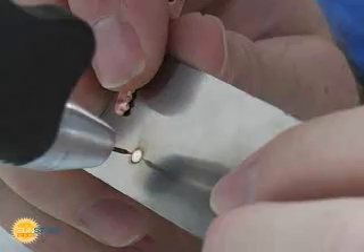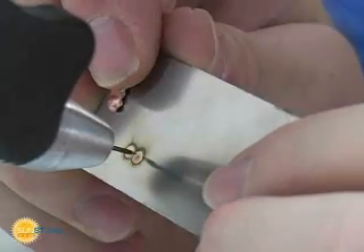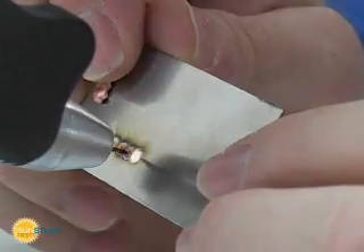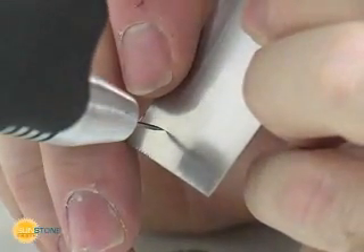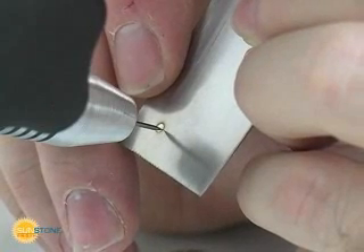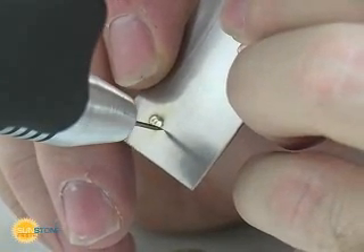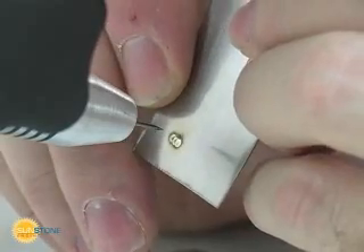The Orion welder is easy to use. Simply touch the electrode carefully to the workpiece surface with light pressure. The Orion computer will complete the welding process by releasing shielding gas and then initiating the weld while retracting the electrode tip. Remove the electrode from the workpiece surface any time before welding to abort the welding process.